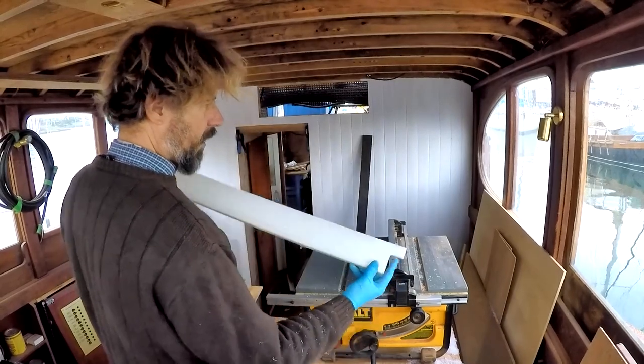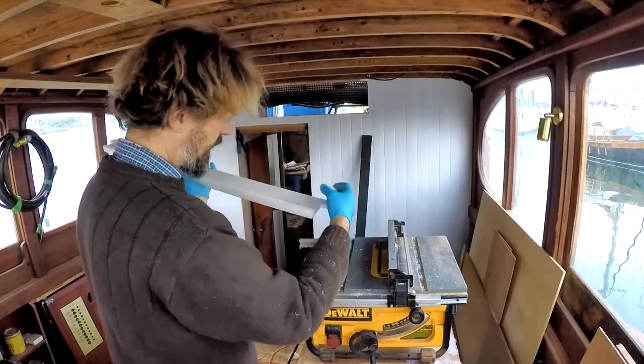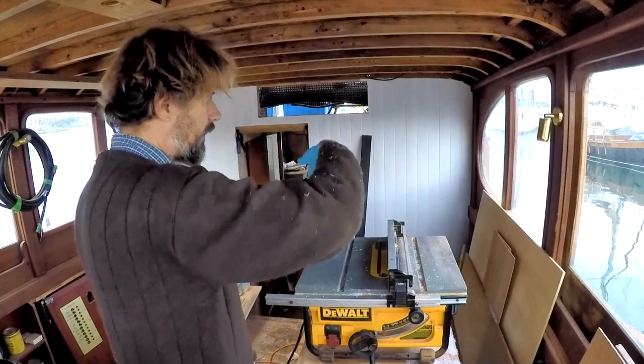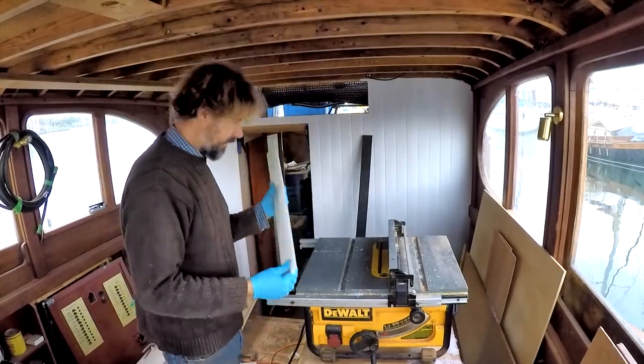Okay, so these are the two notches that make it actually fit in the opening. The extension is so that I can have horns that stick out the side, that's what I call them anyway, so that the trim on the outside can land on top of the extension of the sill, or the sill extension. Okay, it's beginning to be a bit of equity put into this little piece of plastic.